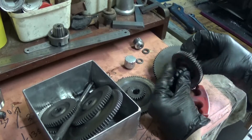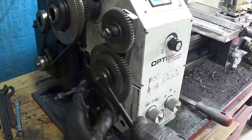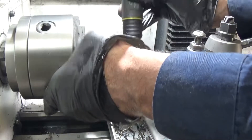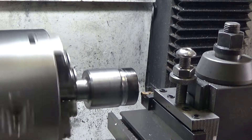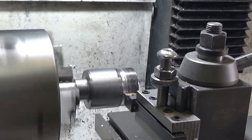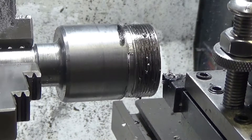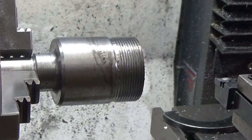It's tedious, but it's only time and I'm retired so time doesn't matter. My lathe does have one of those thread setting wheel thingies that tell you when to engage and disengage the drive, but I find them a pain. So once I start I just leave the drive engaged — I stop, reverse, pull out, reverse, start again — leaving the drive engaged the whole time. I find that's the easiest.